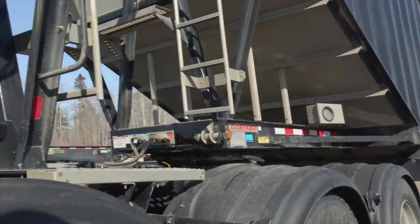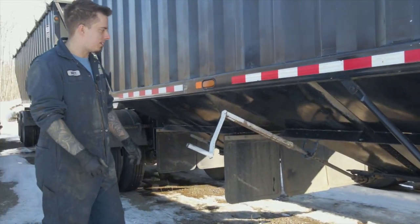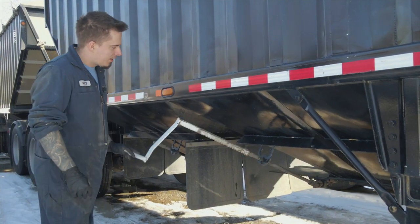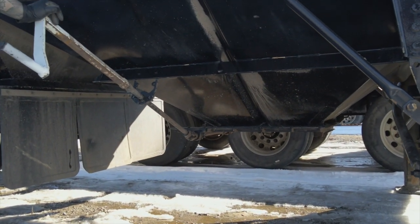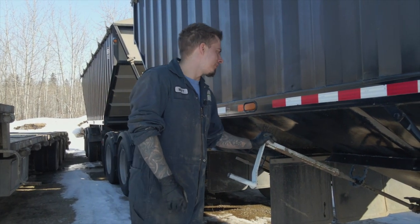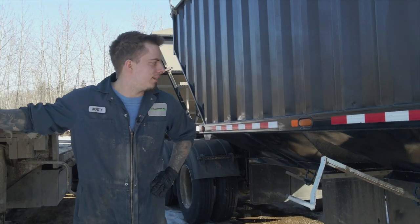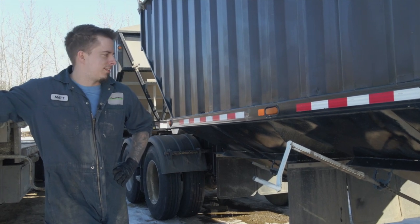For these gates — this is our gate system. They're run off of a chain and sprocket. Turn it counterclockwise to open it up, clockwise to close it on this one. If you have any sort of binding on these sprockets, let the maintenance staff know and we'll get them cleaned up before they become an issue. I would recommend greasing them once a week or so just to make sure the U-joints and bearings don't jam up. But other than that, it's a pretty simple design.